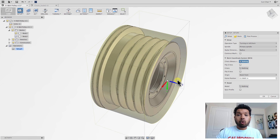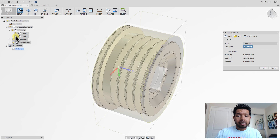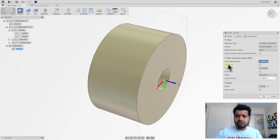What this is all about is orientating the work coordinate system. It's still very similar to the milling side, but you have a little less flexibility because it's really just one direction where the tool is coming from. I already have it set up in the correct orientation. For stock, I'm going to drop down and instead of fixed size cylinder, I'm going to say from solid. What I have already set up in my body is a solid that's been modeled, and I've already drilled through so I can do inside grooving or boring to remove that internal piece.